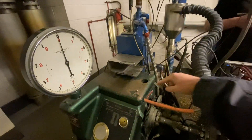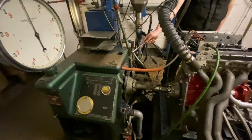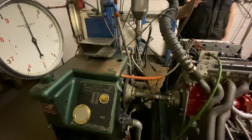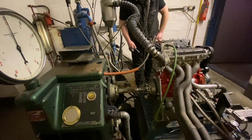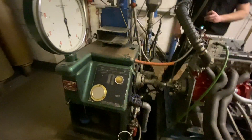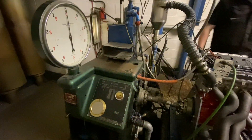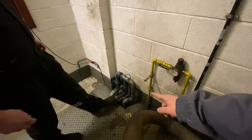As I understand it, the dyno dumps water in and spins a turbine. The water goes in, hits the turbine, and you have a hydraulic flap underneath which you can close and back up the pressure to load the engine. On this side there's a huge pipe with the return back to the tanks. So technically all you're doing is pumping more water into that impeller to stop it from spinning as you're applying load. And that's your engine coolant flow - we also fill and empty the cooling system through that as well.